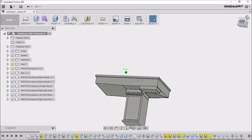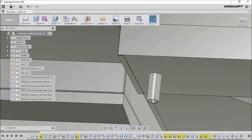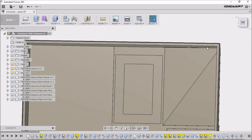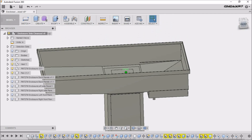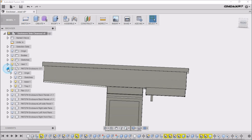On the pan here I welded a one-inch piece of tubing to the bottom of the pan, and that will be to connect up my drain. It may seem small, but this pan is pretty large — it's 10 by 15 — so it's going to collect a lot of liquid, and I think it'll be just fine.